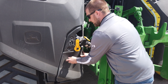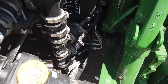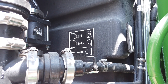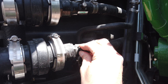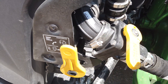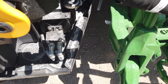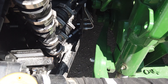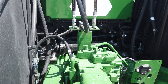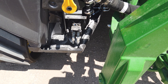The side panel is held in place by a retaining bolt. Inside, we have a hydraulically driven pump and our plumbing, which allows for rinsing and agitation. The top line enables our rinse system and the bottom line runs agitation. Both have valves so they're adjustable — we just make adjustments depending on how aggressively we want to agitate our product. Down lower we see our solution pump, also hydraulically driven. It's important to note that the Xactrate tank system does require a separate SCV, but this is all installed from the factory. All the plumbing and hydraulics are installed, with hydraulic lines running up to a bracket at the top center of the hydraulic stack. We connect our SCVs inside the cab, set our flow level, set it in detent, and that allows us to transfer product — and we can shut it down at will.